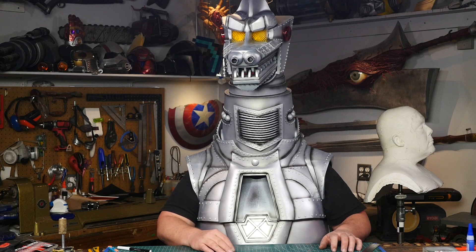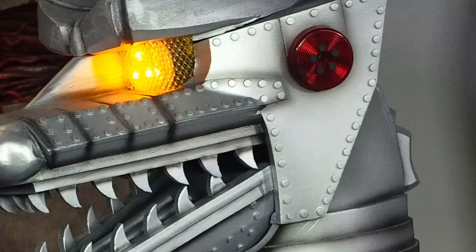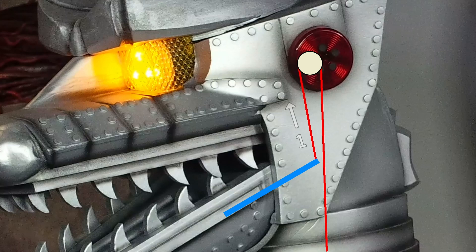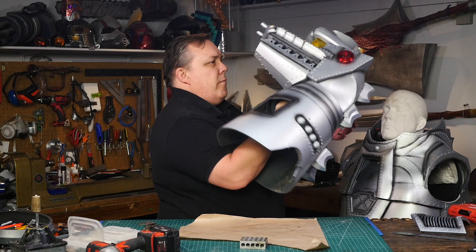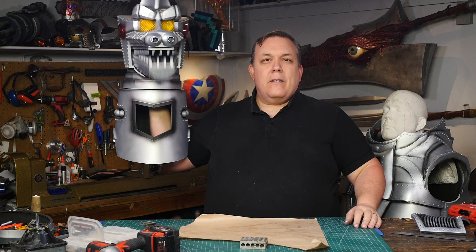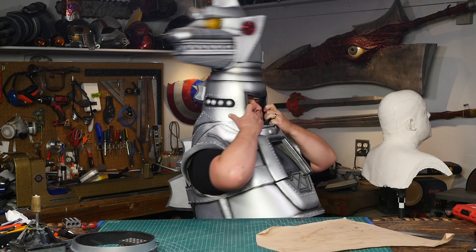It's gonna work and I'll see you again real soon with more Mechagodzilla. There's gonna be lots of different ways you could build to make a Godzilla suit, but this is how Odin makes. One of the things I realized is I'm getting a one-to-one movement ratio with this setup. If I cut the cord and then attach it back to the top of the head and put another pulley inside of this little loop here, I'll actually get a two-to-one ratio for the mouth movement. Hello, I'm Mechagodzilla and I guess it's kind of a puppet. Okay I don't know how dangerous that is so let's not do that anymore, but still.